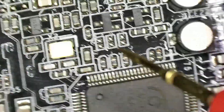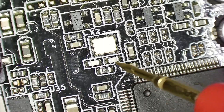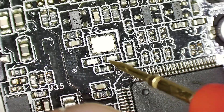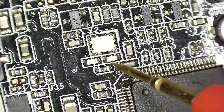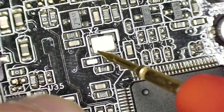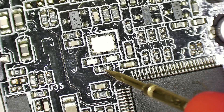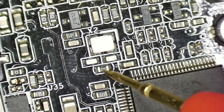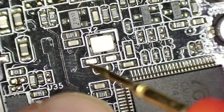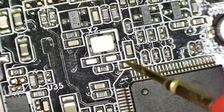When you get it up and running, it's typically running OK, but it's not ideal. You can actually look at this signal and it's going to be bad. What is happening is when you do this, we are either creating a higher capacitance across this or we are changing the resistance. But this is a really low resistor — this is 31 ohms. I don't think that is the case, because typically your finger resistance is a minimum 10 kilo-ohms, typically around 100 kilo-ohms.